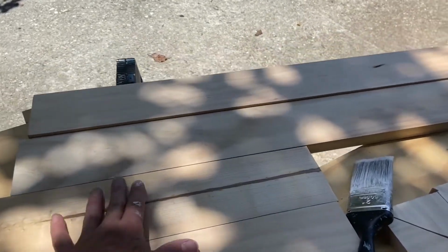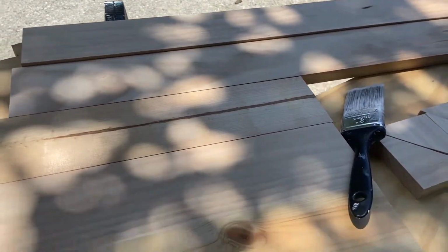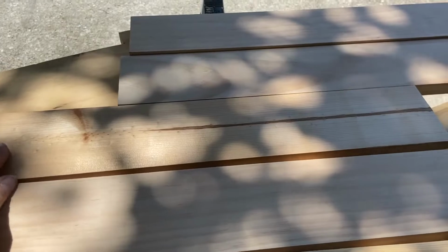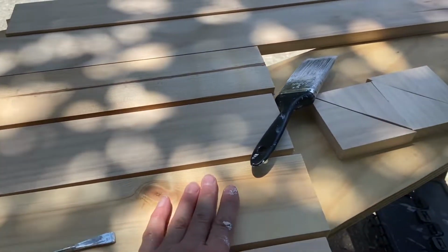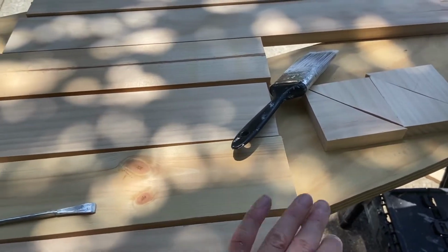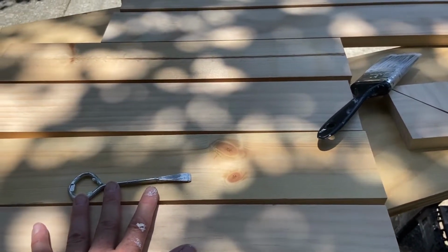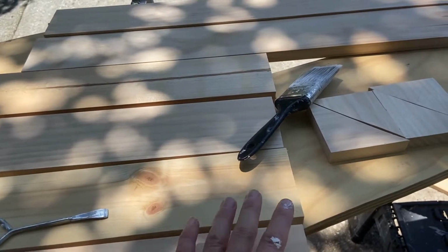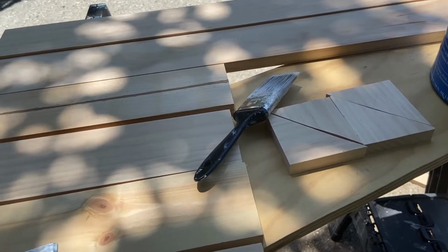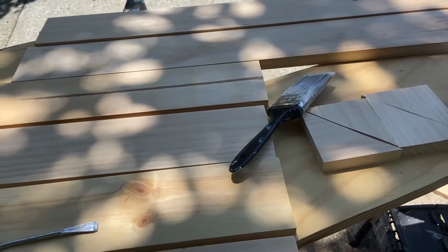It's gonna be 4 feet wide, and there's a 3-inch recess, so it'll be 21 inches deep. So I've got the 4 side pieces that will go across to support. And then I've cut my angle braces as well for extra support. I am gonna put a drawer in on the left side of the cabinet, so there won't be any angle braces in there, but this is good solid wood, and I think just those 4 braces, around 2/3 of the toe kick, it's gonna be just fine.